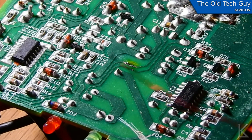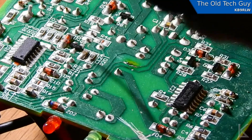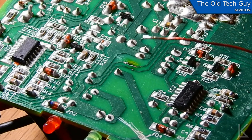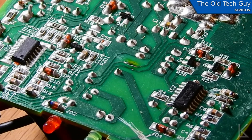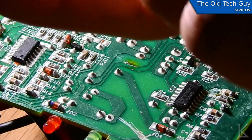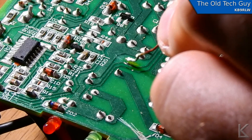Now I'm going to use this little magnet wire. You need to use a pretty fine wire to tap the trace — 32-gauge wire wrap wire, something really fine and small. I've pre-tinned the wire. What I'm going to do is take my needle nose pliers and flatten out about a quarter of an inch of it into a little flattened shape, so that I can hold the wire up off the board and lay the flat part right on the trace.